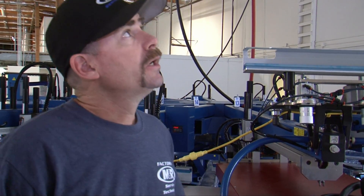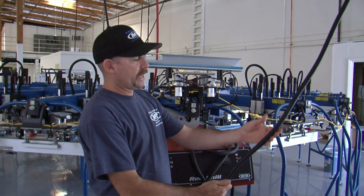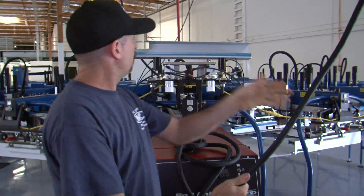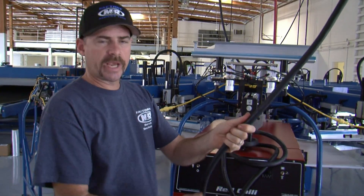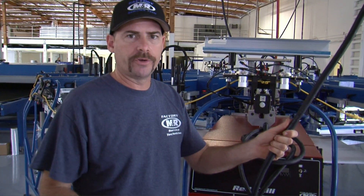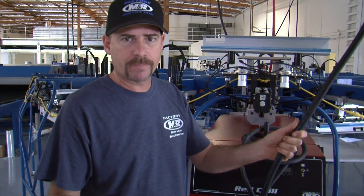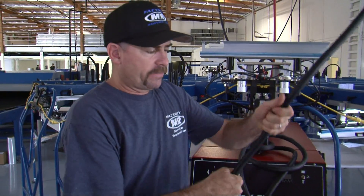The electrical work was done prior to the assembly and installation of the machine. Here we have an example of a flash cable drop. The electricians used SO cable for our flash drops as well as our power being supplied to the press. SO cable is very common. It comes in three and four conductor depending on whether you're using single phase or three phase power. It's oil-resistant cable and it's very flexible.